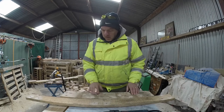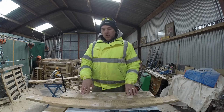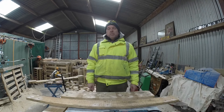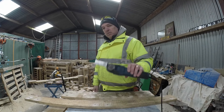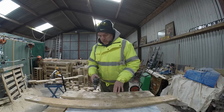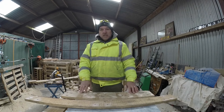I counted the marks I'd made on the wood — I think I did about 16 nails before the blade was gone. Looking on Amazon, the blades are about £8 each. You can buy some metal-specific ones, but they were £33 for a deep plunge one like this — which you need because you need to get in from the sides, especially as these planks are 14 centimetres, so you need to get in from either end at least 7 centimetres. So that was basically a complete epic fail.